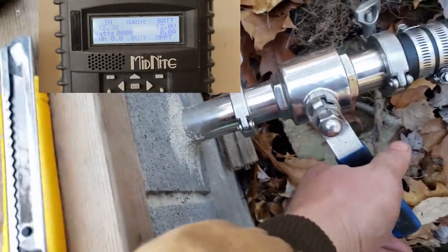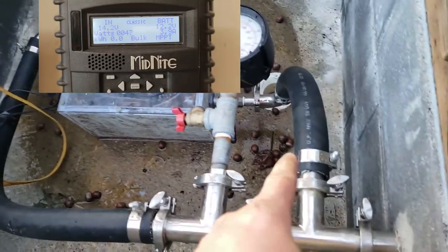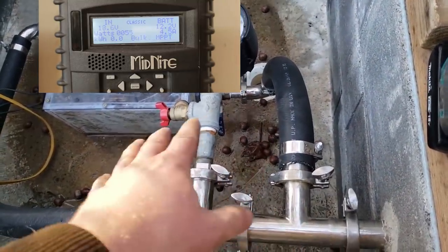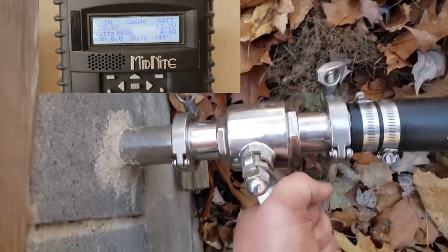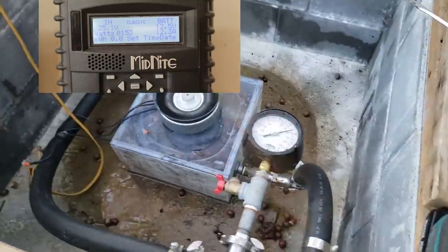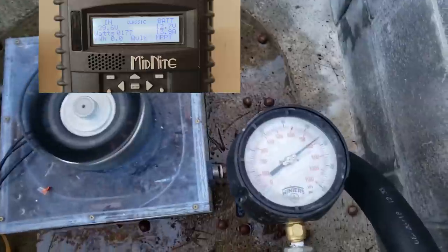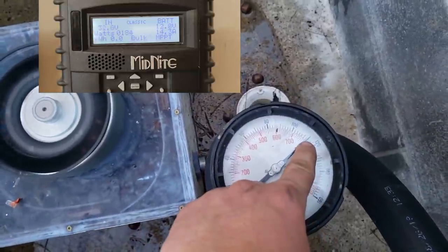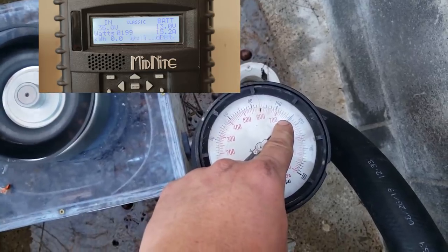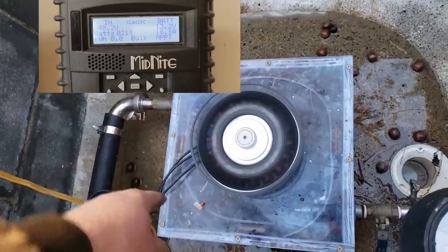That's why — I was pressure testing. I put on this other hose so I was pressure testing that too. We're back up to full dynamic pressure. Notice we only lose about two and a half PSI dynamic pressure when we have the one nozzle going.